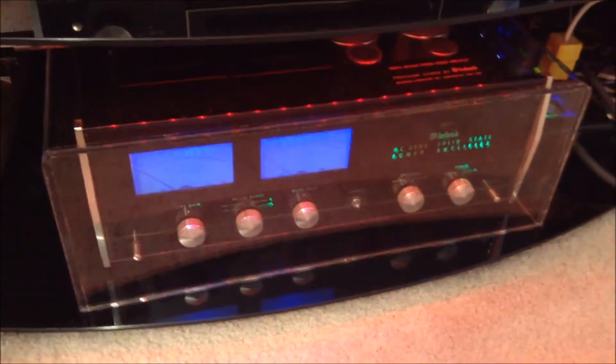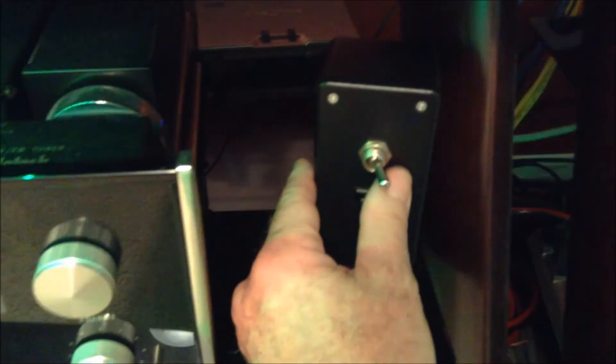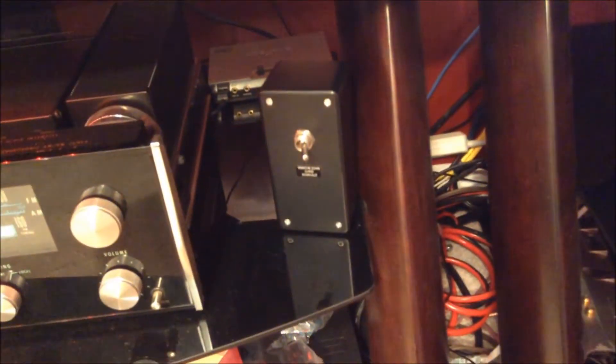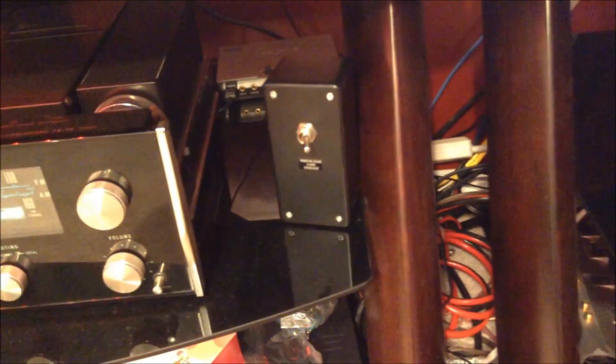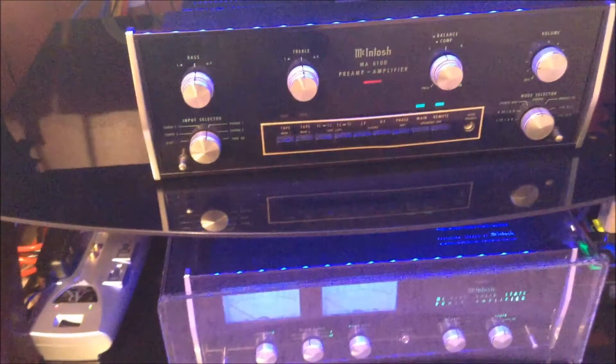With this particular McIntosh amp you can't blow the amplifier by being open circuit, but as a precaution — because both amplifiers are turned on at any one point — this is a three-pole switch, so it has a middle position that's completely open to both amplifiers when switching between them. So you're not going to get any stray currents and blow up your amplifiers. If anybody wants a circuit for that sometime, I can help. You only have to switch the one red wire from each channel and put your grounds together, because it's a common ground to the chassis on all these amplifiers.